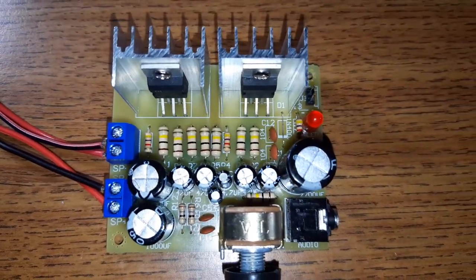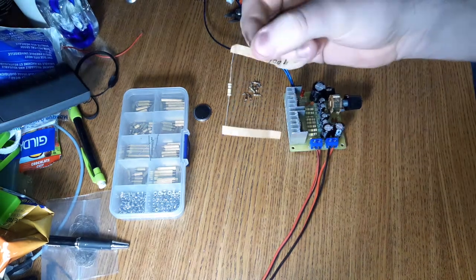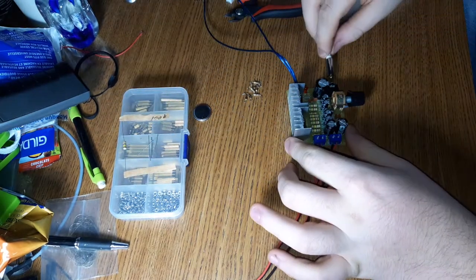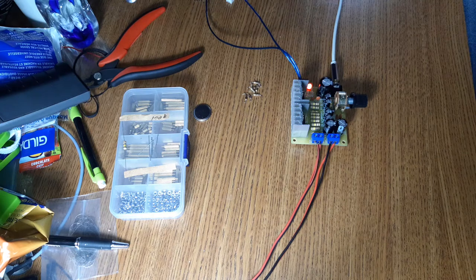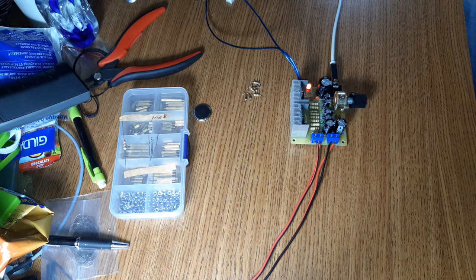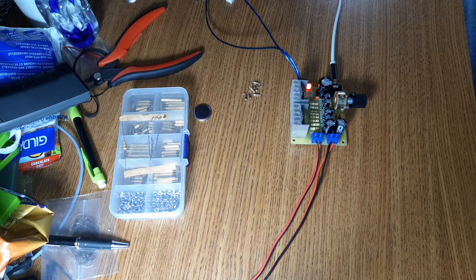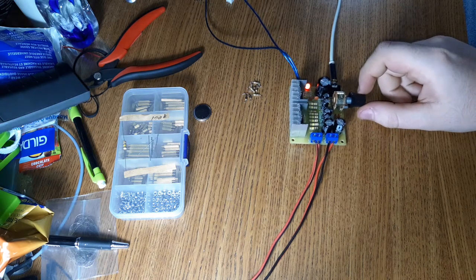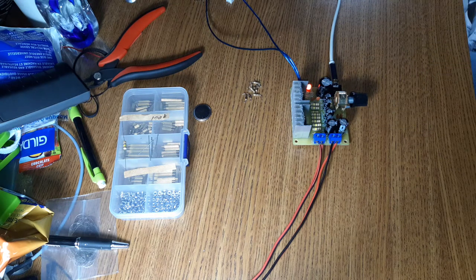I think we're going to try this again. After taking some time, pulling out all the 100-ohm resistors and using all but one of the 100K's from my stash, I think we can try this board again. Power it up — there's not as big a power-on thump this time. It's already louder, and I've barely turned the knob. Supply is on about 15–16 volts. I still need to add a voltmeter to my bench supply — been wanting to do it for three years. Yes, much louder! So well done IC Station — you sent me the wrong resistors, but with 100K's installed it now functions properly.